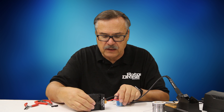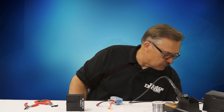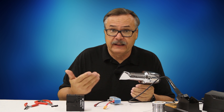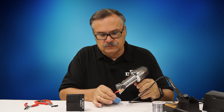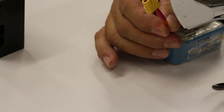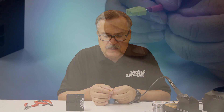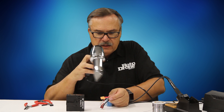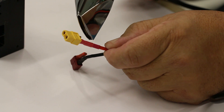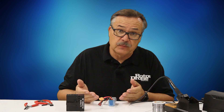Before moving on to the other wire, I want to shrink the tubing down. Once the shrink tubing is on, I heat it on each side to prevent the wires from touching and shorting out. I like to put two layers of shrink tubing on — it gives more gripping power, more holding strength, and it's thicker so a prop strike won't go all the way through.